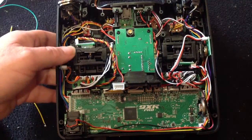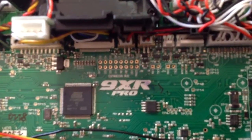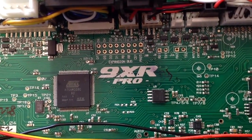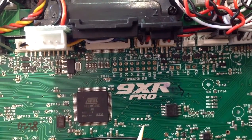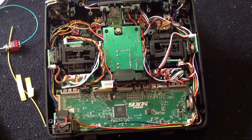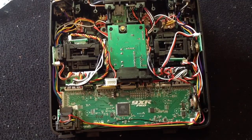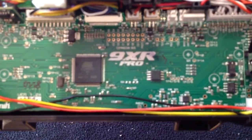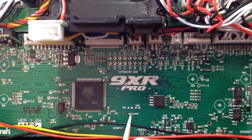To get this switch operating, there's a slight modification you need to make to the PCB, and this is the only one you need to make. If we bring it up closer, you'll see R22. See how there's nothing in R22? What you need to do is solder a jumper across to make that contact. I've soldered a little bit of wire across this contact, so R22 is bridged.